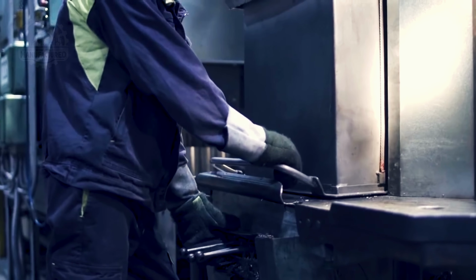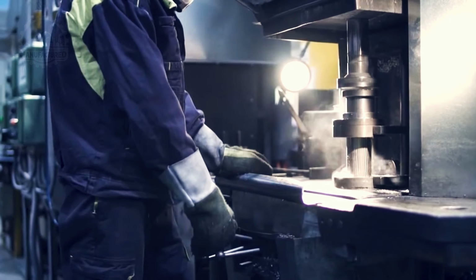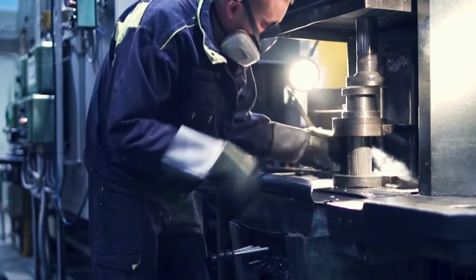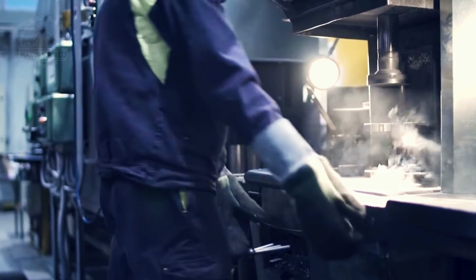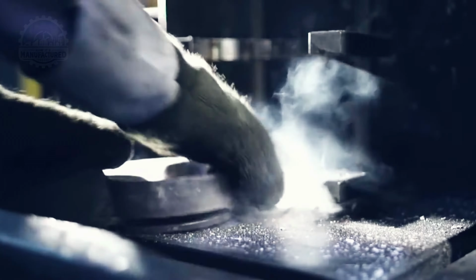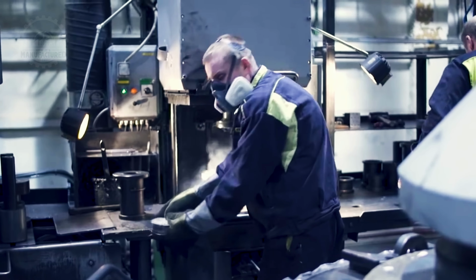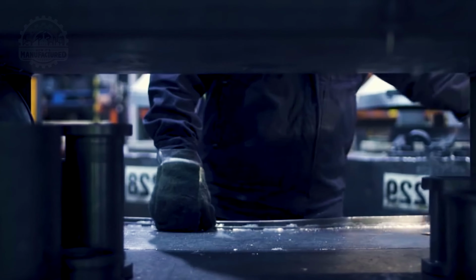Pour it slightly unevenly, and air bubbles will fill the grooves. Cool it too fast and the metal shrinks, resulting in vacuum bubbles. Do it in higher than required humidity and the composition will be completely ruined, as excess water in the air will end up in molten aluminum, where in turn it breaks down the oxygen and hydrogen, forming unwanted oxygen slag and hydrogen bubbles.